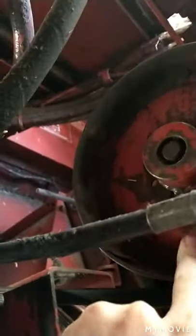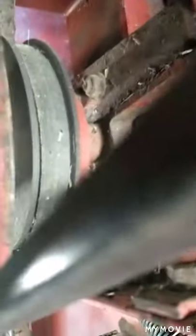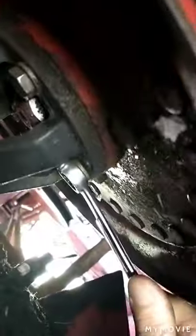I got the belt on - I know there's a bunch of close-up shots but I'm six foot two and I'm in a small hole, so there's not much bending for me. You can see this pulley right here goes on top of the belt at the top. I tightened down two of the four bolts already, had the belt on, and I'm about to fall off my special mechanic tool - a five gallon bucket I'm standing on. What you do is just tighten down those four bolts, and once you have those four bolts tight you're good.